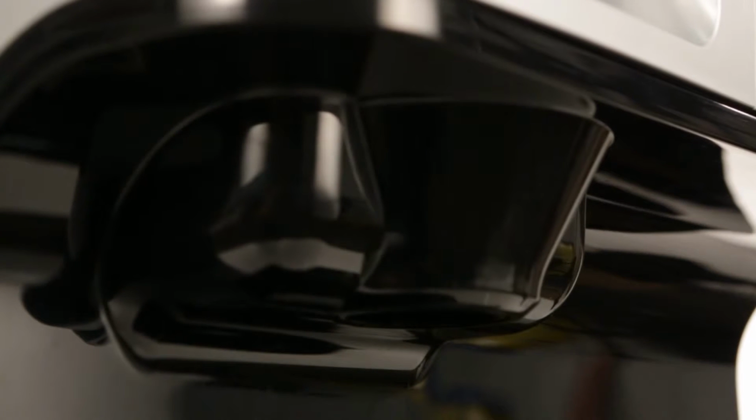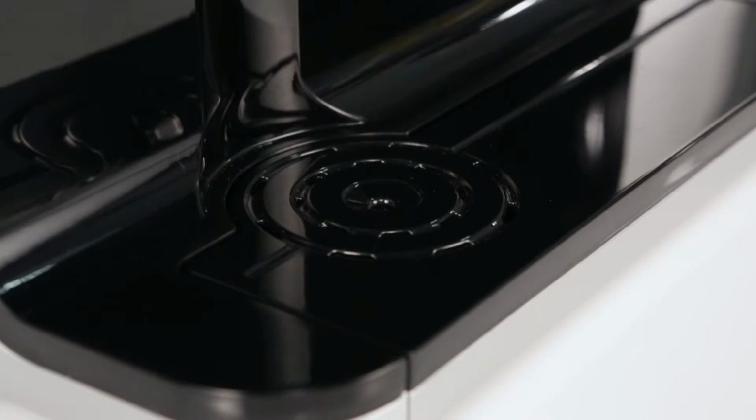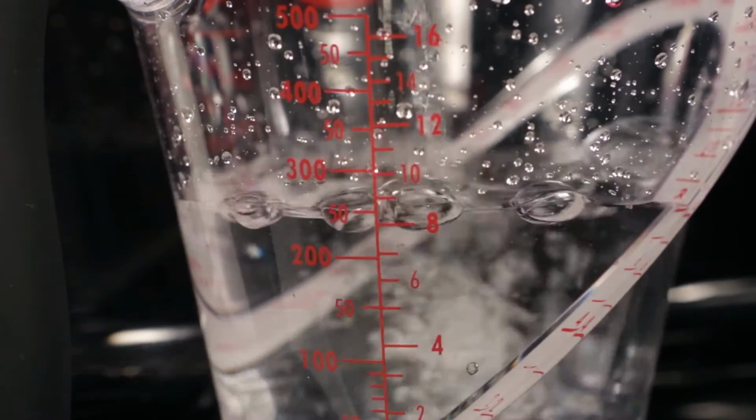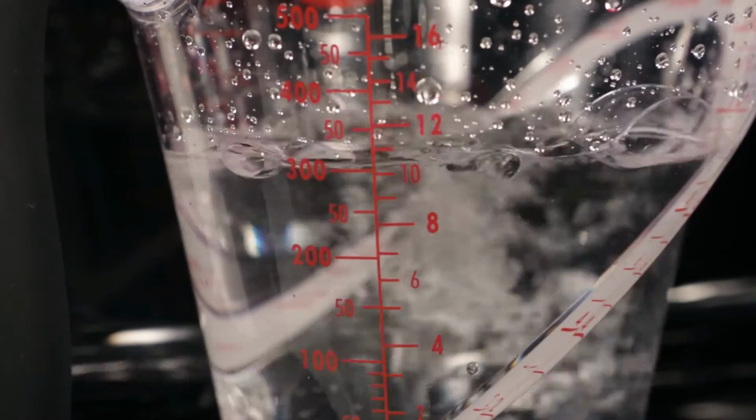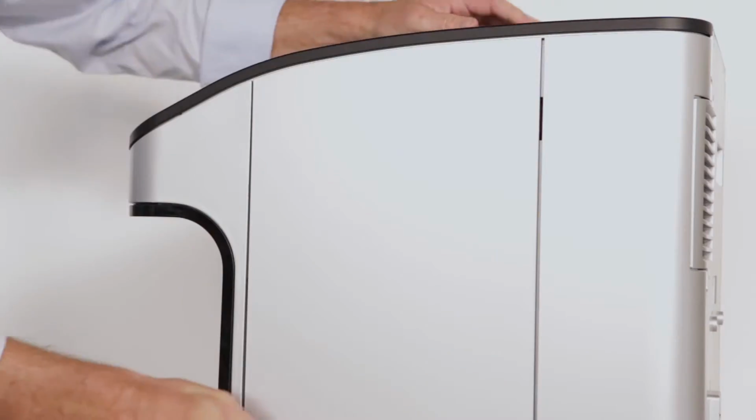Remember to first clear any air from the mix line by dispensing for about 5 seconds with the Mix Cal On button. Then go through the same 12-ounce or 355 milliliter calibration sequence. Finally, you will calibrate the sparkling stream.